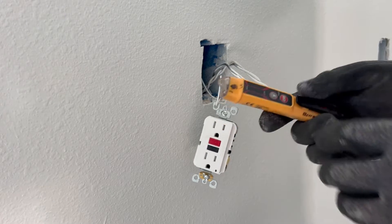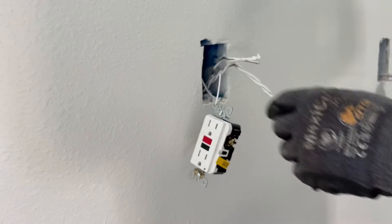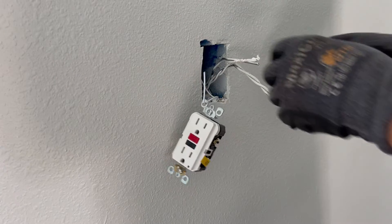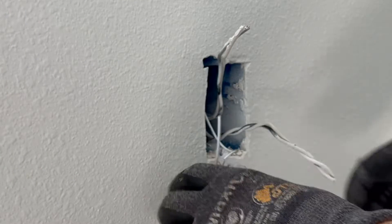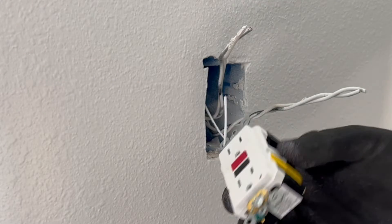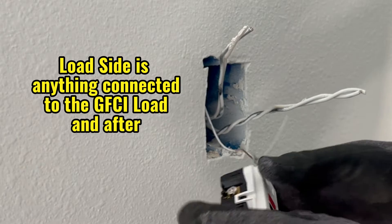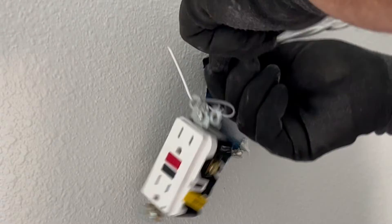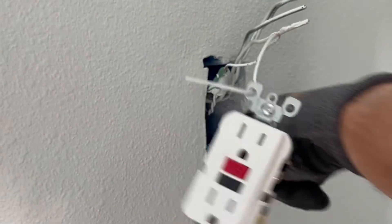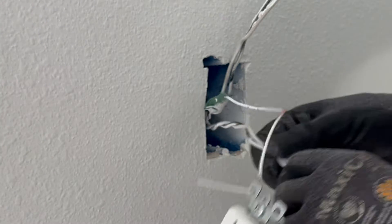Okay, there's nothing — we're good. So this outlet, this GFI, will be feeding another outlet right next to it. So how we do it out in the field is the line side will always be twisted — basically the one coming from the electrical panel. That has to be on the line side. The load side on here is always covered with a piece of tape or something, and they have to be in that order. If they're not in that order, the GFI won't work properly.